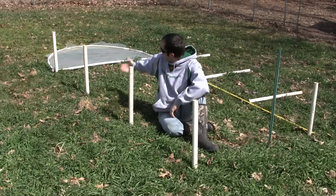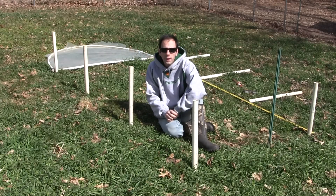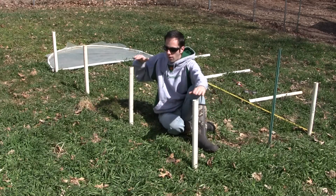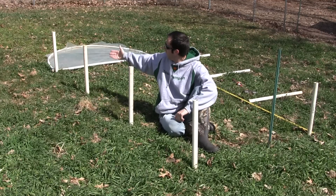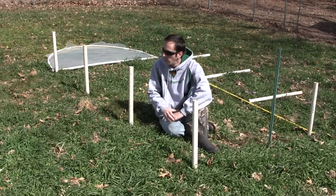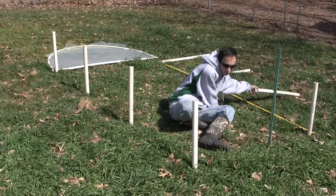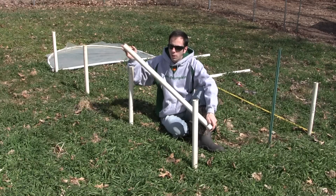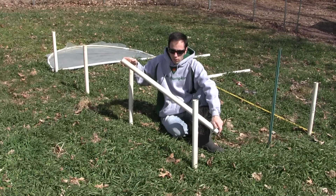Once that's marked, I then move the door to the other side to ensure everything is square. I then use my tape measure to measure out every 3 feet and put an anchor in. My cold frames are approximately 5 feet by 9 feet long, so every 3 feet I take one of the anchors — the inch and a quarter, cut to 3 feet 4 inches — because that allows me to get 3 per every 10-foot length, which comes in standard.